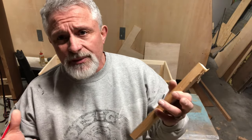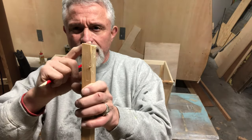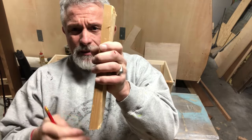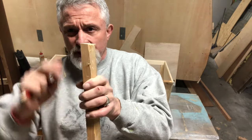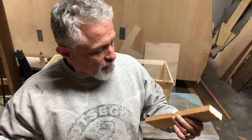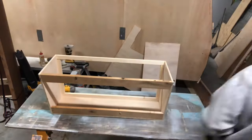Cut this, something you do need to know, sorry to stop the double time, but 10 degree angle right here. 10 degree, 10 degree. Long side, long side. 10 and 5/8, yep, measure it. My measurement's going to be different, okay? So, let's nail it in.